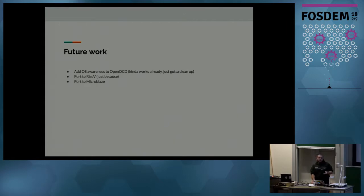So the question was how much overhead you have by using Chromium-EC compared to the binary itself. Okay, so I can tell you for my case, the microcontroller I'm using has 128K flash and 16K SRAM. That's enough for two full copies of the firmware. Chromium-EC is probably not a good call for just about any project.